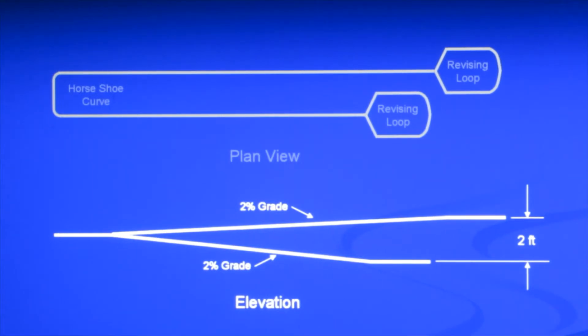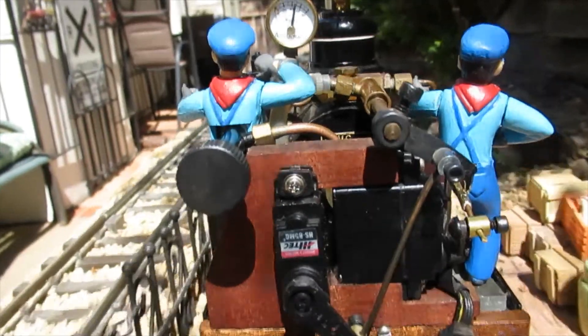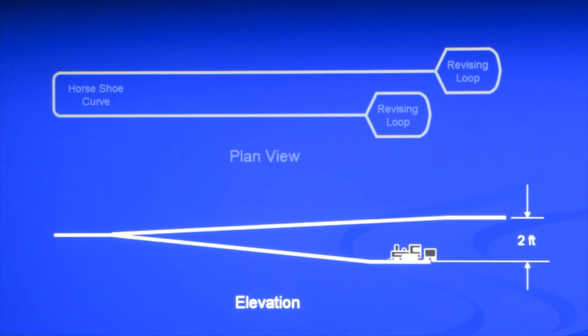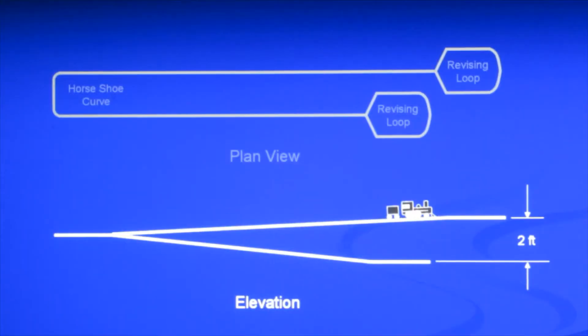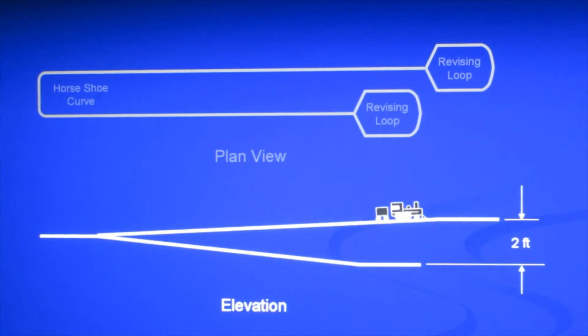The steam strategy for this route is to position the train at the base of the grade, manually set the burner to generate steam for a steady speed on level track, and allow the pressure to build to 50 psi. As the train climbs halfway up the grade, pressure drops to 40 psi and the throttle is opened to compensate. At the top of the grade, pressure dips to 30 psi — enough for the train to circle the loop and drift back downgrade. Drifting down uses very little steam, so boiler pressure returns to 50 psi. The train circles the lower loop and is ready to climb the grade once again.